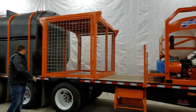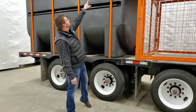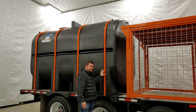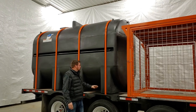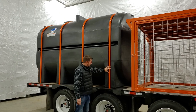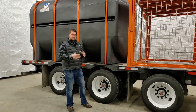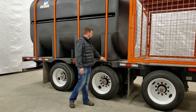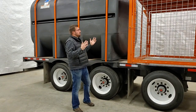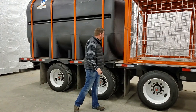When you're bolting tanks down, make sure they're not right tight on the tank, especially if it's cool out. If it's a really hot day, it's fine for them to be tight. But these tanks do expand in the sun, so leave a little room for that expansion. The bolts underneath — make sure you've got a washer, especially if going through wood. The load is really front to back on these tanks, not side to side, so just think about that when mounting.